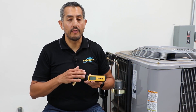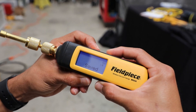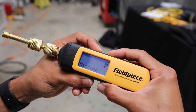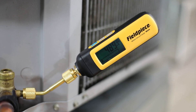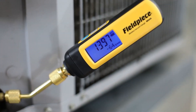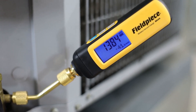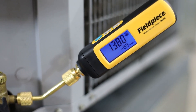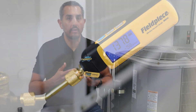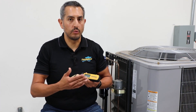The MG44 has customizable high and low alarms to indicate to the technician when the desired vacuum levels have been reached. On the display of the vacuum gauge you have two rows of information. The top row will always show you the real-time pressure reading of your vacuum. It defaults to the unit of microns but can be changed to other international units as well.